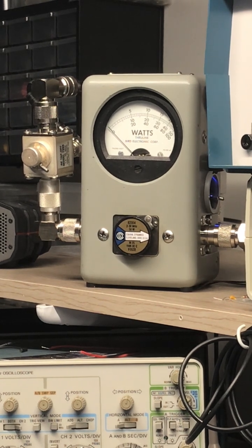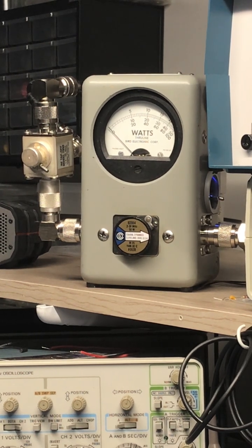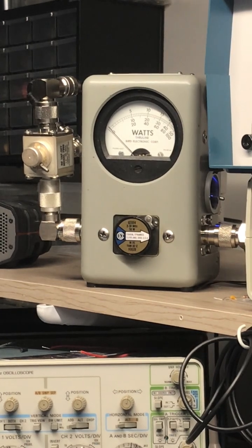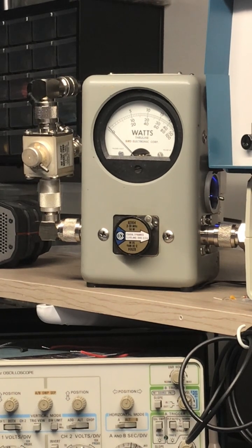If you divide the swing by the dead key, they're up there in the middle of the band, up to 30 to 1. You know, 5 watt dead key swinging 150. So this thing's going to be an audio monster, and I hope Brian likes it. He should love this thing. It's going to be awesome. So anyway, I think that's it.